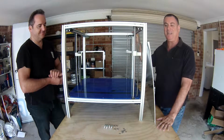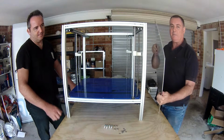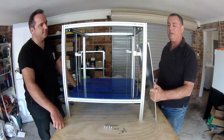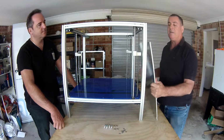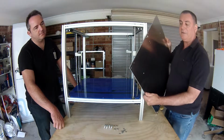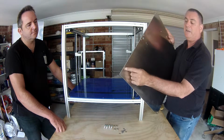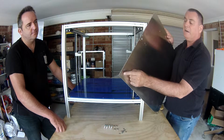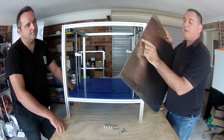These are the pieces you'll need to install the bed plate. Big aluminium plate here, which is the base, nuts, bolts and washers. Now there is a sidedness or a handedness to do with this plate, and it's around this hole here. It's the only hole along this side. This is where the central Z-axis trapezoidal rod goes.